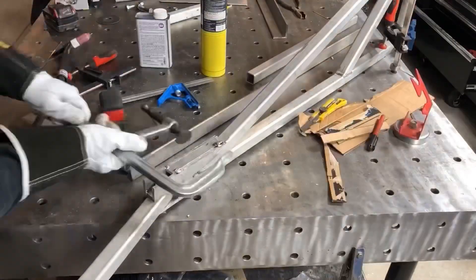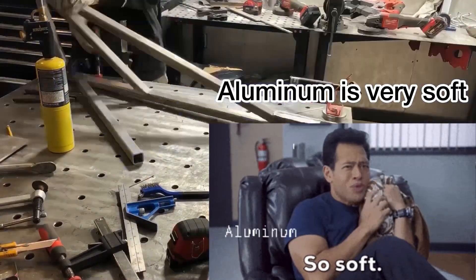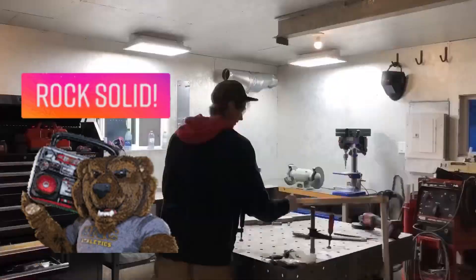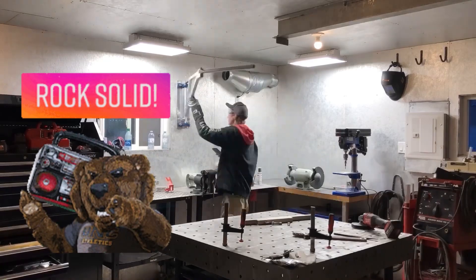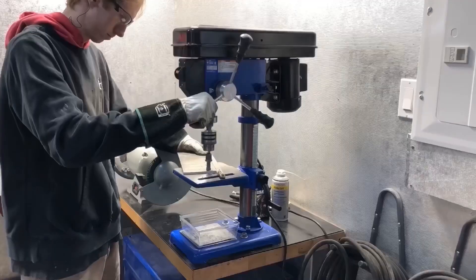So I had to add these gussets on the back because I didn't think about it, but it started bending the plate as it got some pressure on it. So I had to put these gussets in to give it some downward support from the top and bottom — and now it's real solid. Piece by piece, put it in, try it out, go on to the next one.